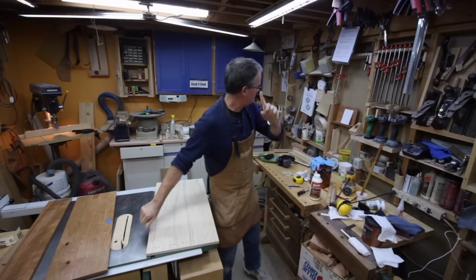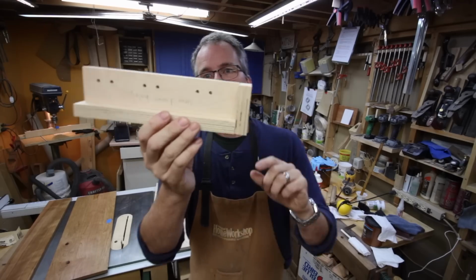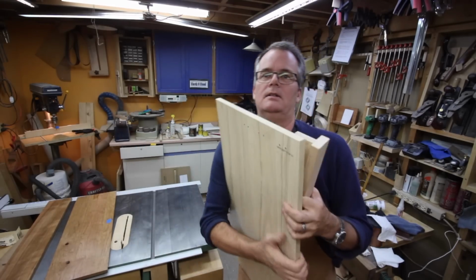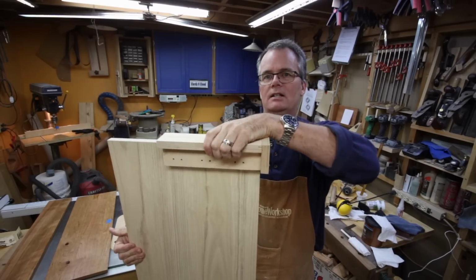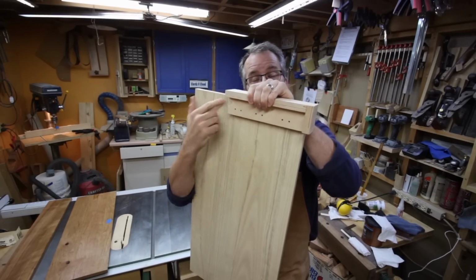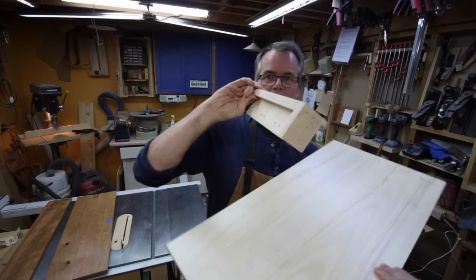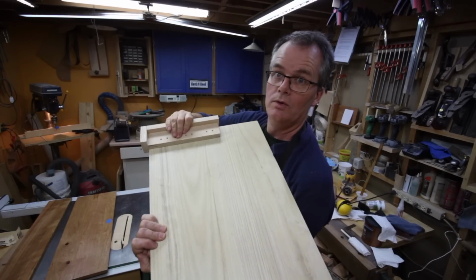And then I made myself a little jig like this. Here we go, here's the holes on the board, and this jig lines up here so it locks into place on the corner, and it's got all the holes that I need. And then it's reversible, so I just take this jig and flip it over, and then I can do the other holes.